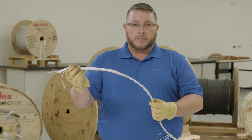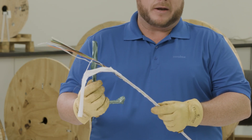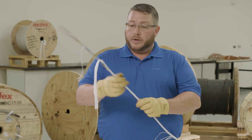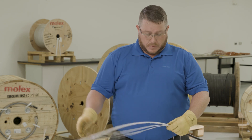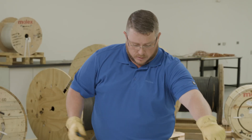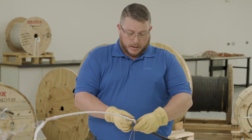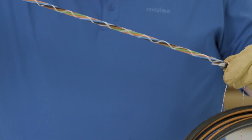Those of you who have opened cables before are probably noticing that this ribbon is still intact. Unlike our peers, we have the ability to make our shield not bond to this ribbon. This is really important because as you apply bonding clips to this cable for installation, you can't have material between the bonding clip and the shield. With ours, as you pull the shield off, it comes off in its entirety and leaves everything else intact. With three simple cuts, I can remove all of this material: one cut removes the four water blocking cords, the second removes the ribbon holding the water blocking ribbon, and the third cut removes the last layer of water blocking. Now the cable is exposed quite rapidly and simply.